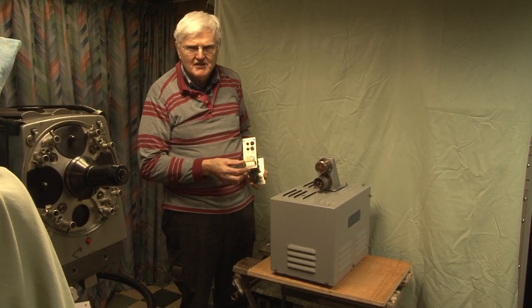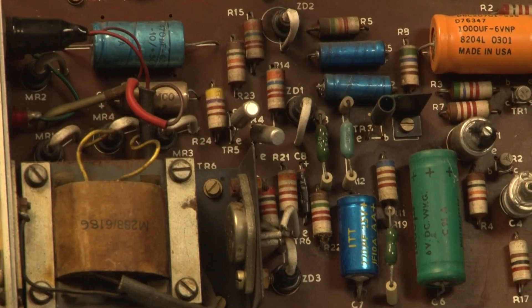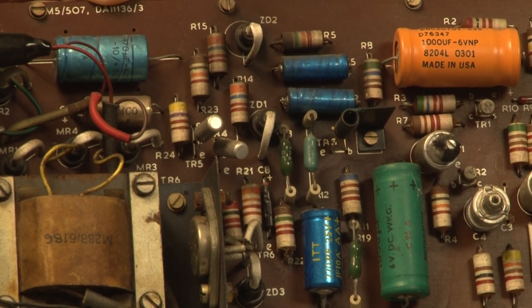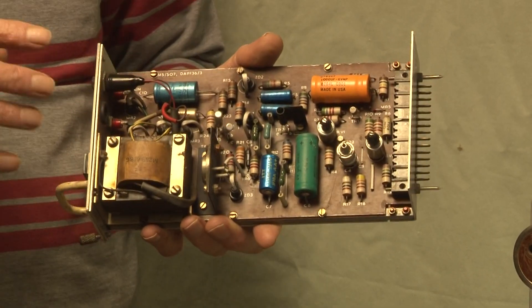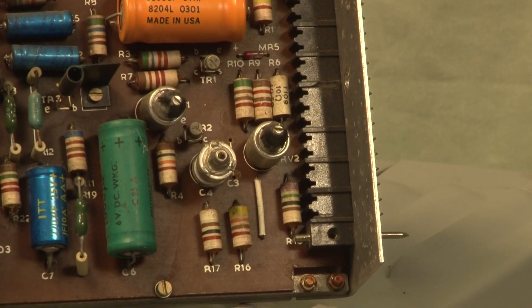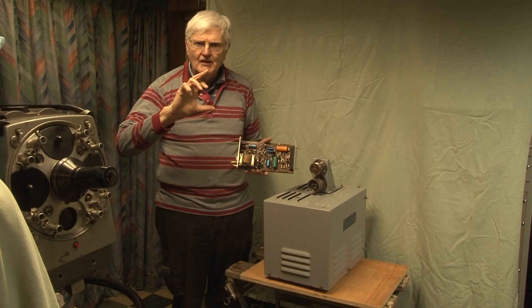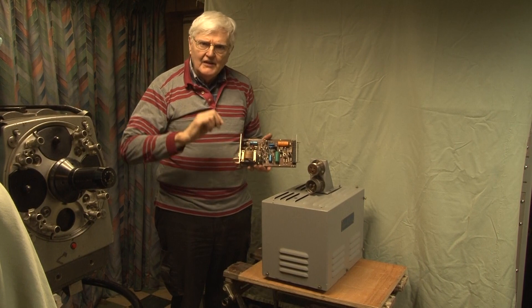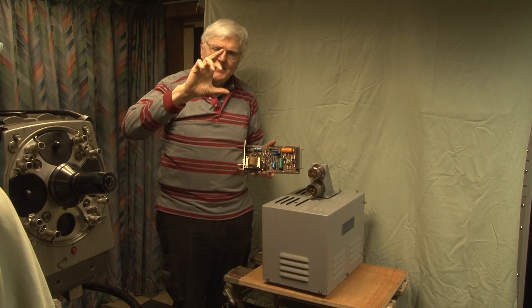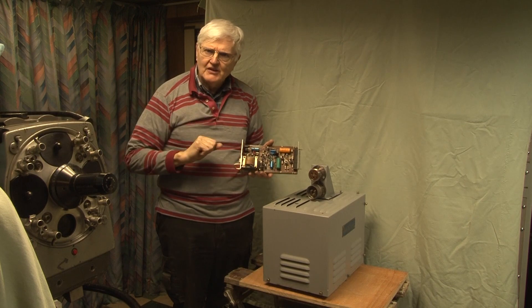This is a typical BBC distribution amplifier unit and it has its own input transformer and regulator. You'll see that the heatsink on this is quite small. That's because it only needs to correct for a modest range of input voltages — this is the headroom — also a certain amount to do with any ripple which is on the smoothed DC. If you think about this input window, the height, the amount of voltage that is surplus that the regulator is going to burn off, all this makes for heat.